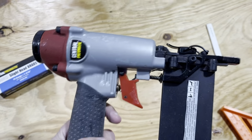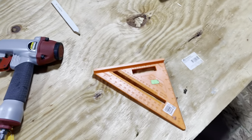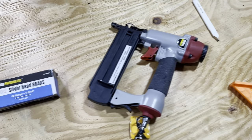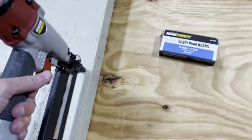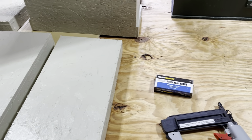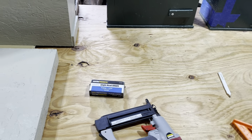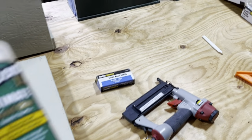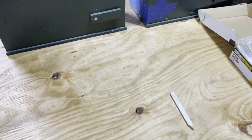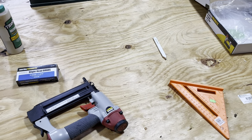For speed and ease I use a brad nailer — also from Harbor Freight, Central Pneumatic — which does both nails and staples. I use 18-gauge 1-and-3/16-inch nails. It just goes through them a lot faster. There are other ways of fastening — screws, pound nails — but one thing you do need is glue. I use Titebond; I've used Titebond 3. It fills in all the gaps, and if bees are in there long enough they'll take care of the rest.